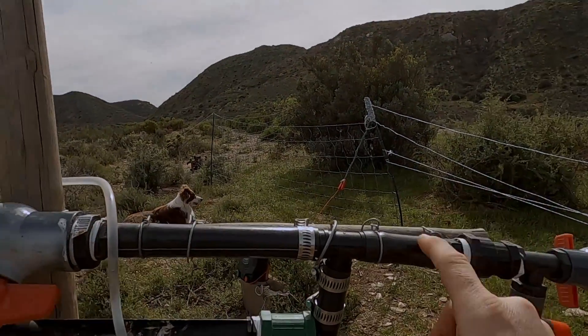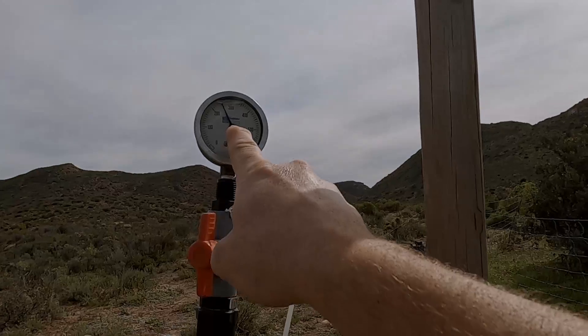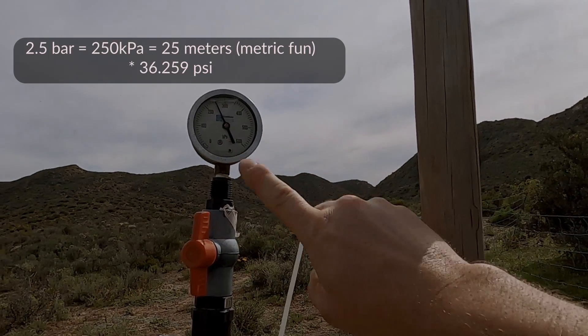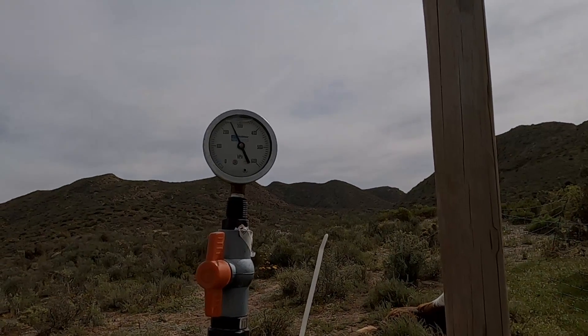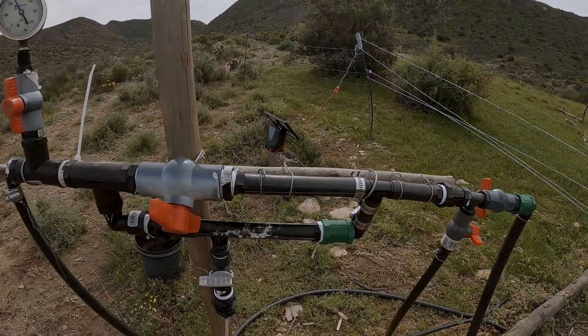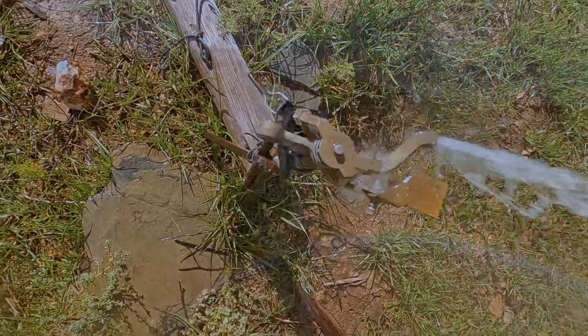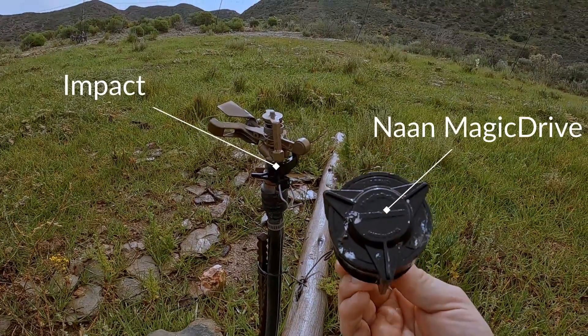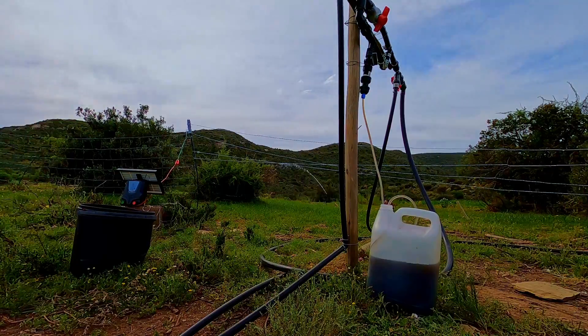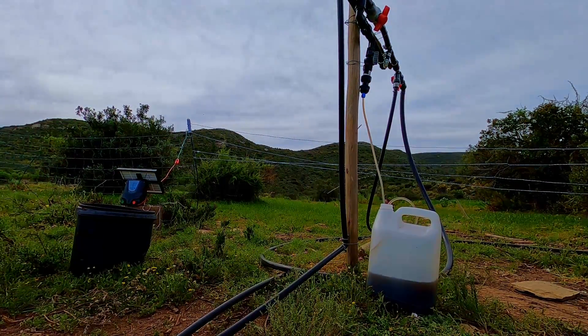My incoming pressure is two and a half bars, because the supply tank is about 25 meters above where we use this irrigator. For me it's a bit of trial and error — I don't have sufficient pressure drop on the other side. I need to have both sprinklers open, which means my 15mm main line can't keep up with the flow and I lose radius. That's why connecting the impact sprinkler, which has a higher flow, allows it to operate on its own while still producing sufficient vacuum to pull the fertilizer into the main line and deliver it to the crop circle.